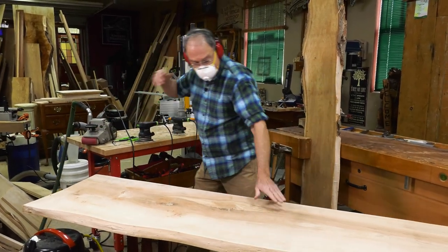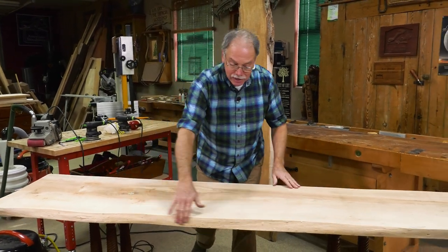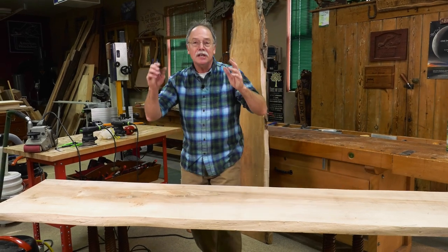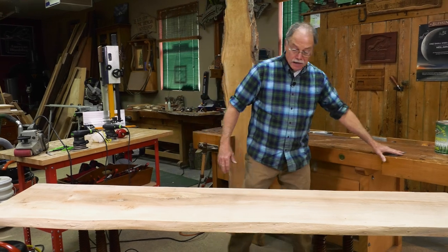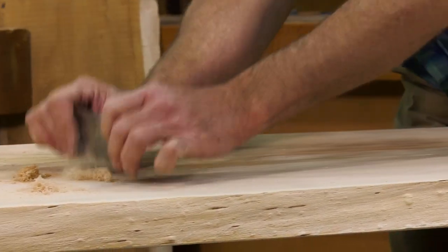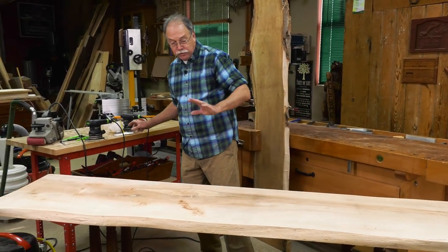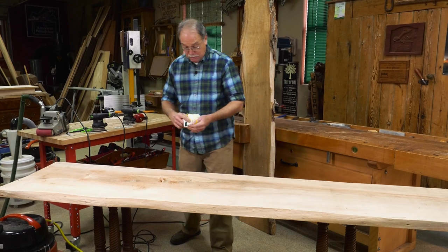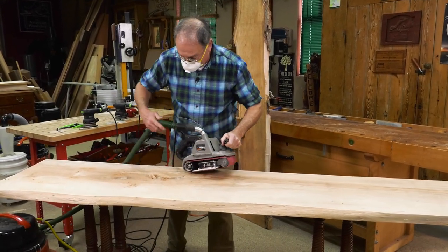Take a look at this beautiful table. I'm the third woodworker of this show and I love live edge work. This tree blew down on our American Woodshop property in a storm — live edge, you can't beat it. The bark has come off of it. Susie and I have a deal: I do all the sanding and prep work, she does the finishing. One of the handiest things — other than a belt sander with 60-grit abrasive — are card scrapers. I'll get this sanded all the way through 220 and cleaned off, then take it to Susie's finishing barn. Be sure to wear a dust mask and use good dust collection, and keep the metal platen flat to the wood and keep it moving.